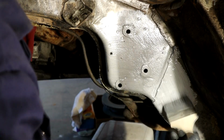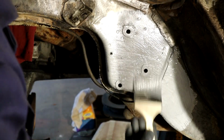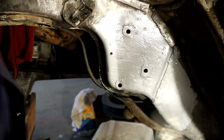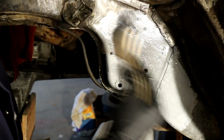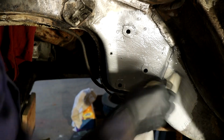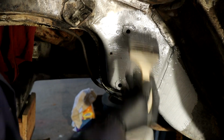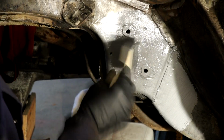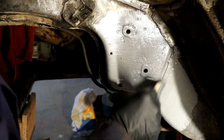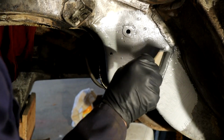I was thinking in certain areas when we take it back to metal on the wheel arches, especially splash areas where you're getting a lot of water, treating those areas with this, then key sanding this up with the Scotch-Brite and then epoxy primer over this, because this takes care of the pitted areas that I'm not sure epoxy does. Let me know if anyone knows out there.